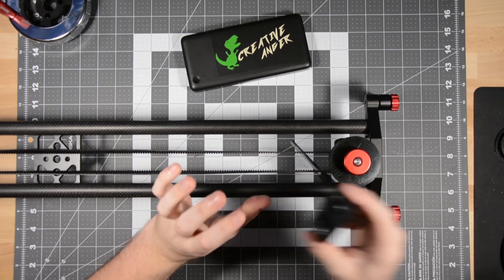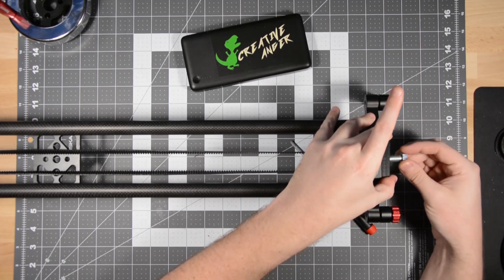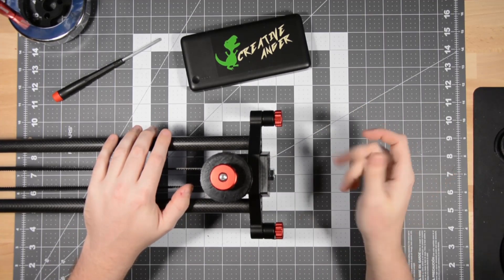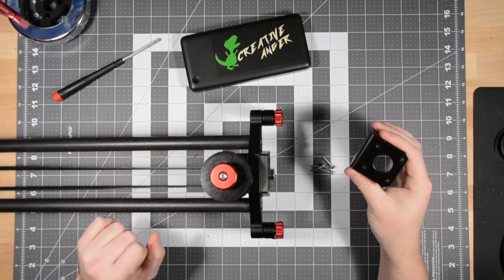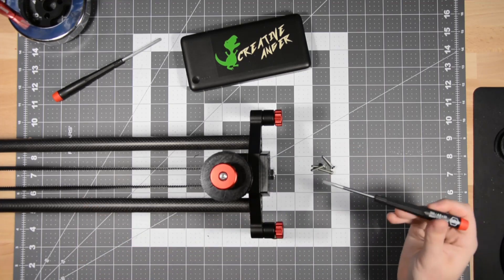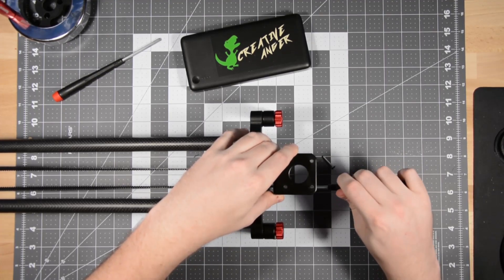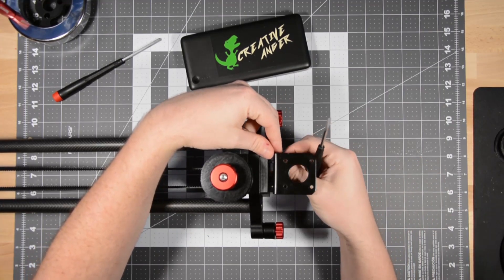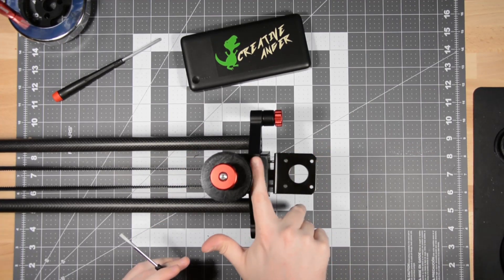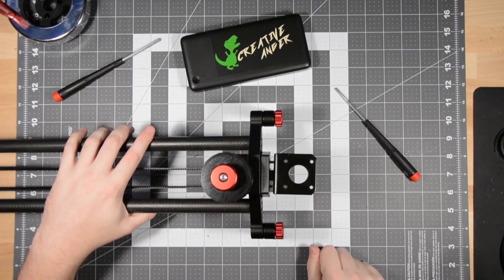I can mount it right here on the side and take a 3/8-inch bolt that is 3/4-inch long and screw it into place. I have a standard NEMA 23 motor mount that just bolts right onto the side — it's an extremely simple process requiring only a single screwdriver. I insert the two bottom screws first, tighten them until there's some tension, then insert the top two screws. At this point they're barely finger tight. I need to loosen the two bottom screws so this plate will level with the top. Once it's level, I go ahead and screw it down. Now we have a motor mount.